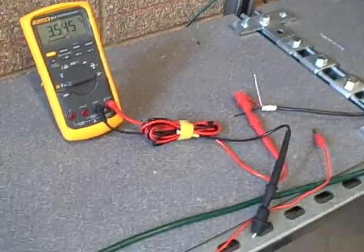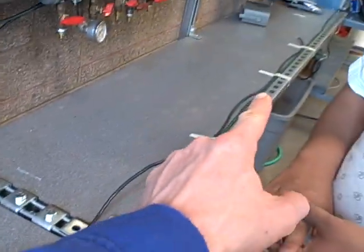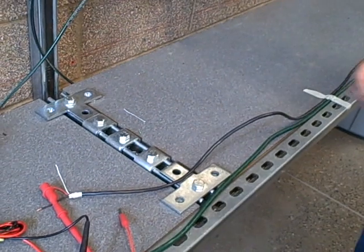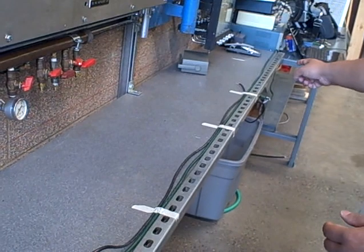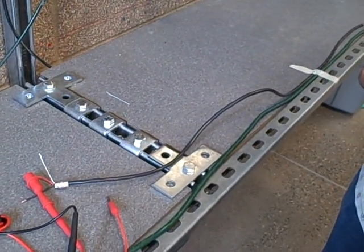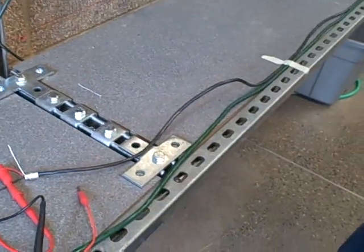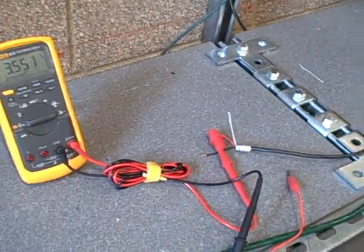There's a reason why we should only ground the signal cable at one location — we should not have the shield grounded at both ends. If you have a connection at both ends of your cable, you will create what's called an earth ground loop, which will basically return us to this problem because of the earth conductivity. You actually have a loop where earth ground current could pass through the cable, which can cause all kinds of noise and other problems.